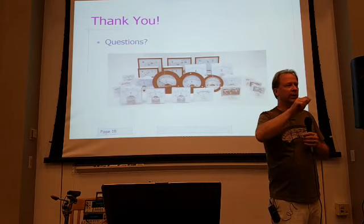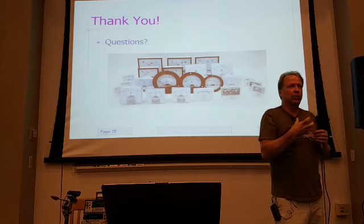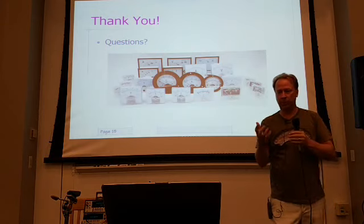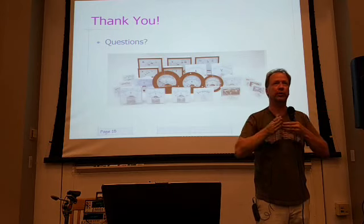Even things like the switch design, to switch the different modes. The good meters will generally have a real good mechanical switch with multiple leaf contacts. The cheap meters will be a piece of metal stuck in the end of plastic that's riding across circuit board traces that can corrode.